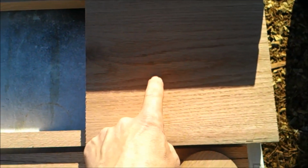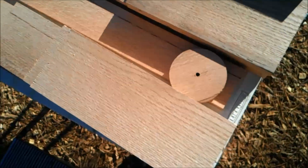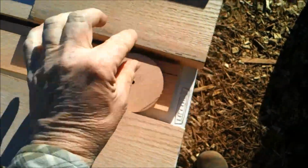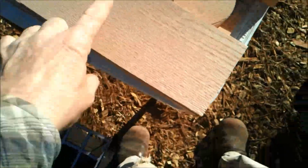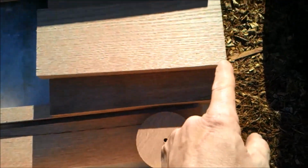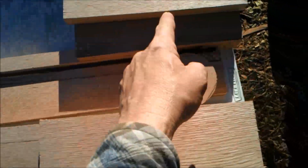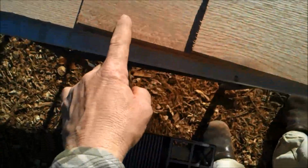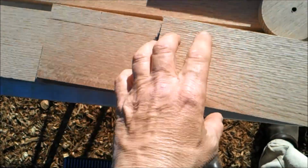And these lengths were cut according to that width, minus the widths of those two. So they sit on there nice and cleanly. This is going to be 3/4 of an inch longer, so you have a 3/8 extension on either end, so that I can put it into a dado that will go between the 2 verticals.